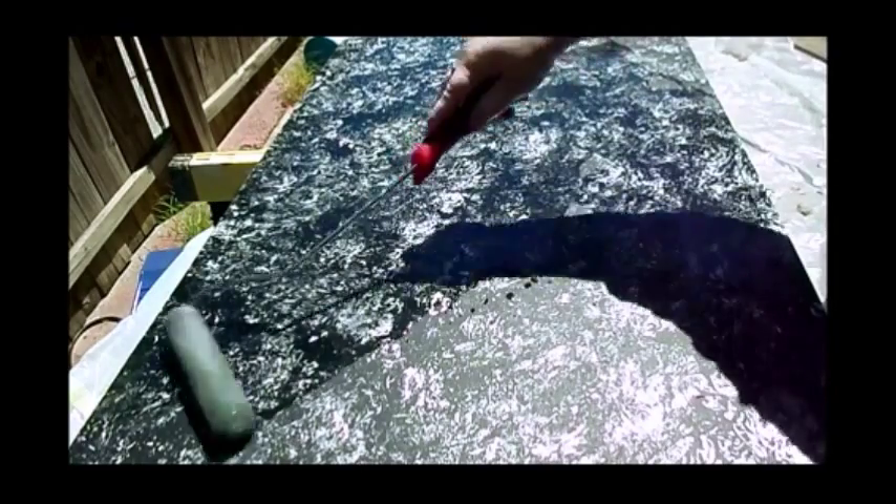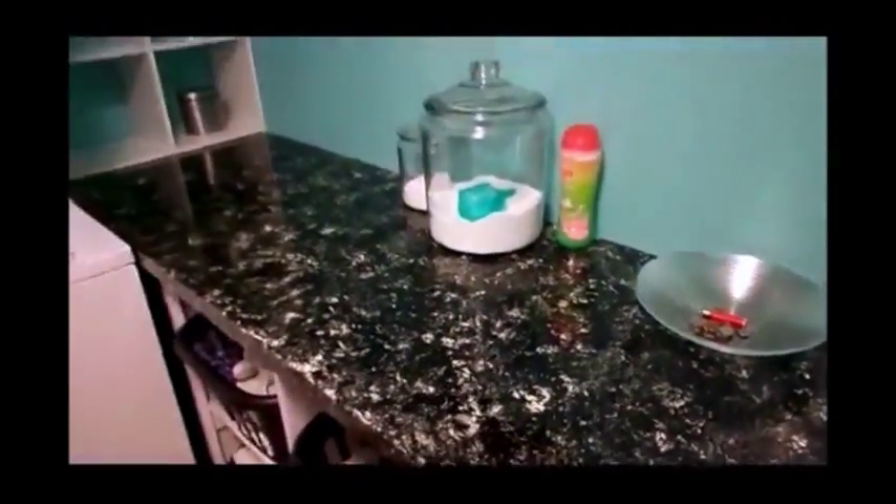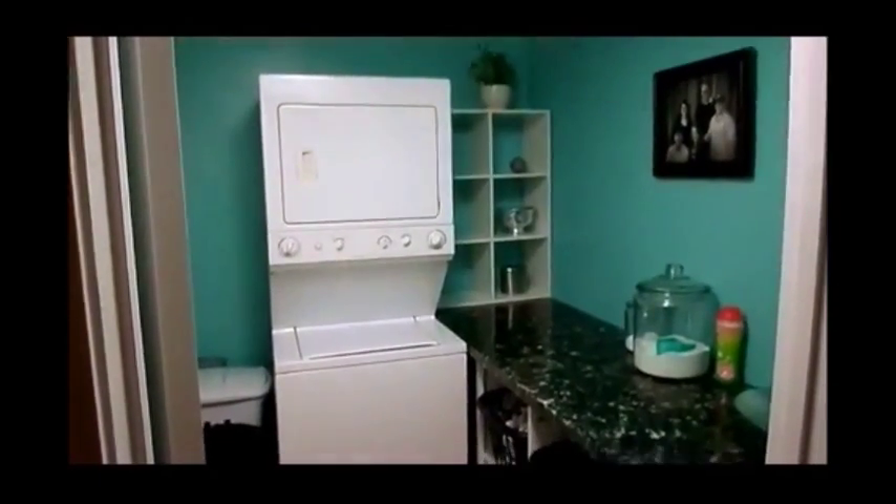However many coats of sealer you want to put on — I put about three really heavy coats, which would probably equal around six coats. You let it dry between each coat; you can sand it if you want, but I don't. I put about three to six coats on there. This is what it looks like finished — I love it. It's very inexpensive, very easy, and I really like the look. It holds up well, and in a laundry room it'll hold up until I get tired of it and redo it. I hope you can use this technique somewhere in your house — thanks for watching!